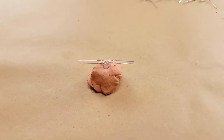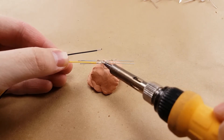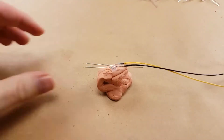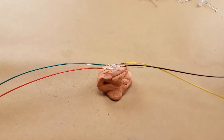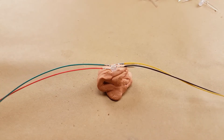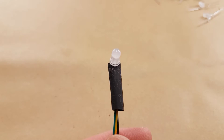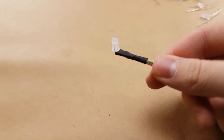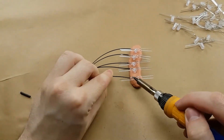Now we are going to make the first three LEDs. These ones don't have any other LEDs connecting to them so they are the end of the strings. It's very important to heat shrink the legs since they are so close together — it's extremely easy to short them out and cause issues, so definitely make sure you put heat shrink on here. Next we are going to solder all of the wires to the LEDs so when we're assembling things it is all pre-attached.